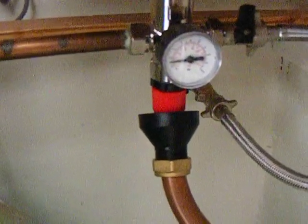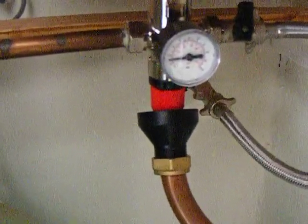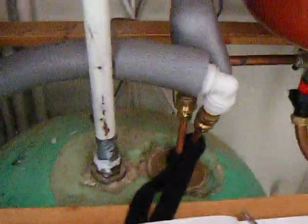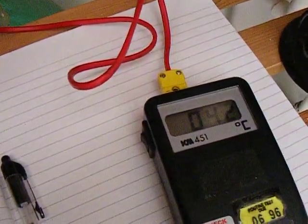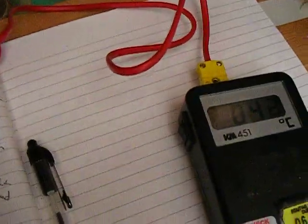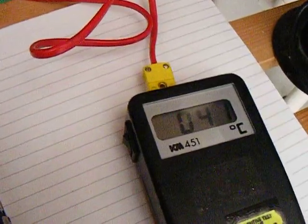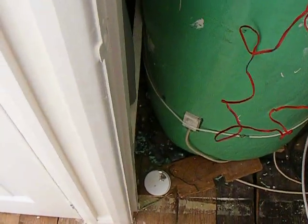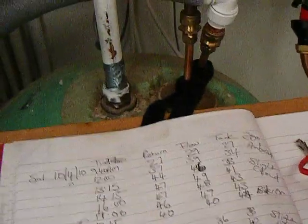At the moment it looks like it's at about 1.5 bar. It sounds like the pump has actually stopped now. Flows at 42°C, return presumably the same. Cylinder temperature is about 41-42°C at the top of the cylinder. I'm not going to punch any more holes through the cylinder. I'm hoping the central heating boiler is going to just kick in at about half past six and finish off. Most of the time we've had a two-degree temperature differential between flow and return.